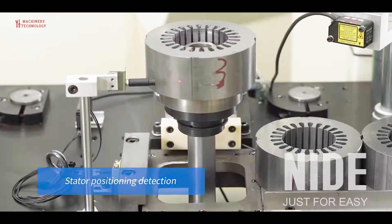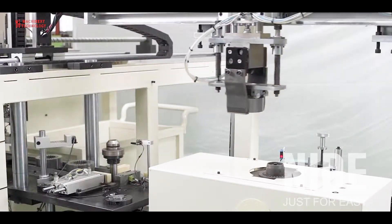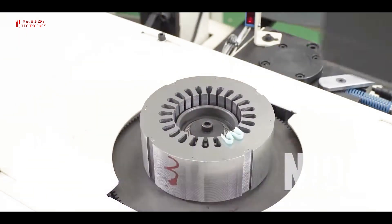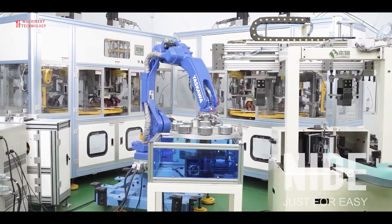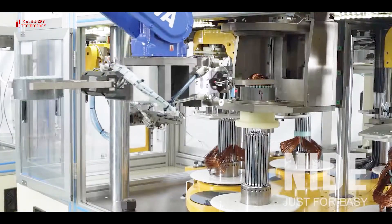The structure of the stator is similar to that of a three-phase synchronous motor, while the structure of the rotor differs between different machines. The stator is constructed from layers of high-grade alloy steel to reduce eddy current losses. It has three main parts: the outer frame, stator core, and stator windings.